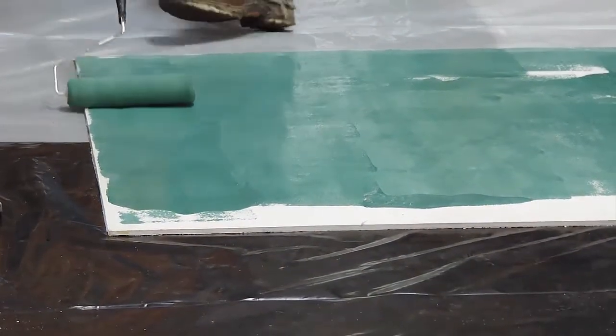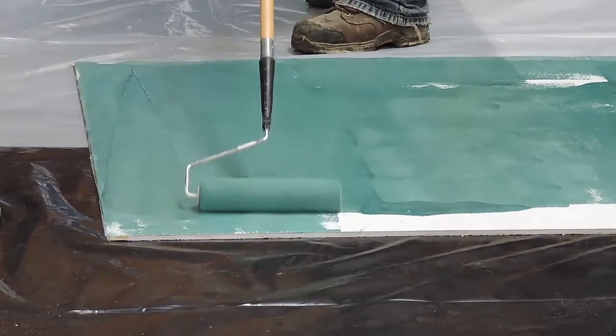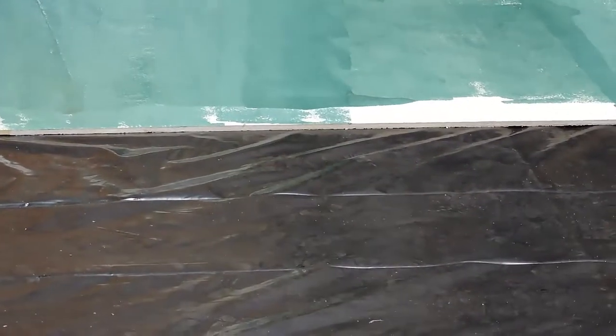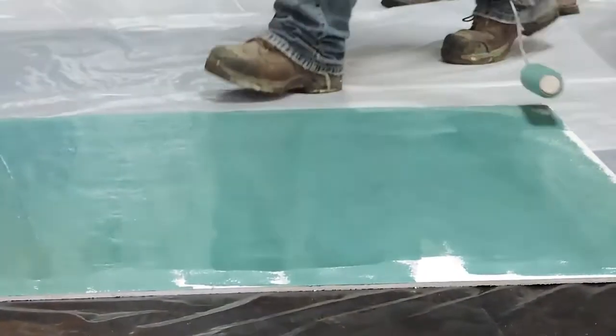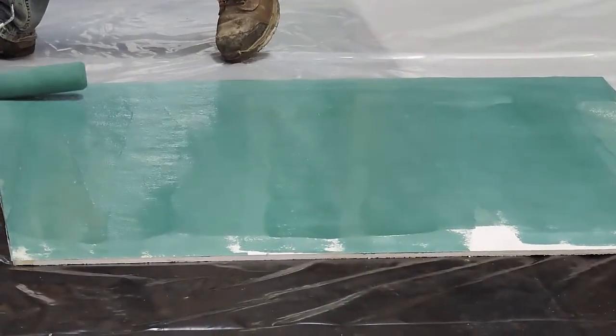You don't want to put metal effects straight on the concrete because of contaminants. If a drywall guy dropped mud and left residue, and you put epoxy on that, it fish-eyes all over the place. Also, if your metal effects coat is thin in some areas, you can see the base coat color coming through underneath.